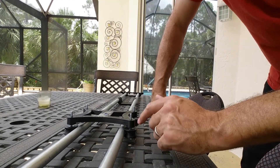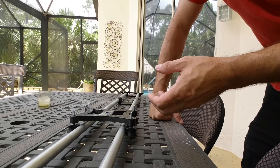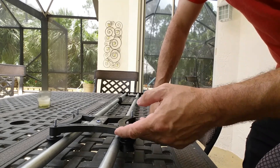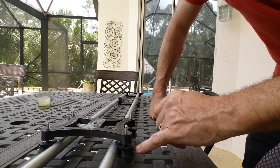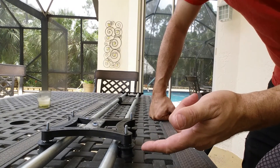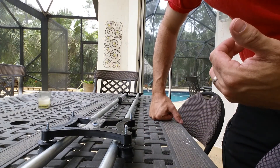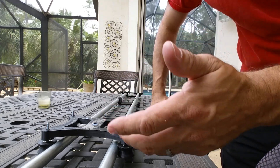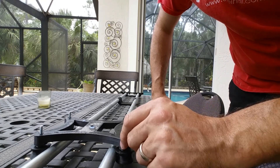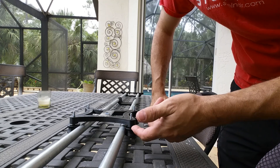I was going to redesign the wheel and use two brass sleeves. I figured it was the imprecision of the fit of assembling, but when I started modeling brand new wheels I found out that these designs — however they got to me, I downloaded them from Thingiverse — the end product wasn't concentric. The wheel doesn't actually rotate about its center properly, and it has nothing to do with the assembly or the bearing.